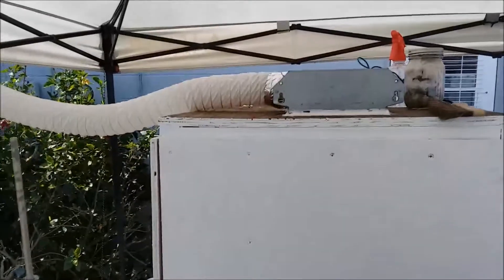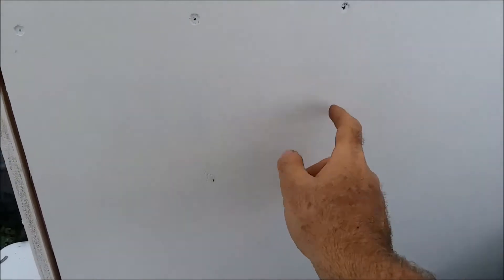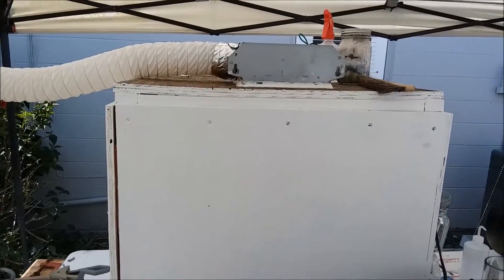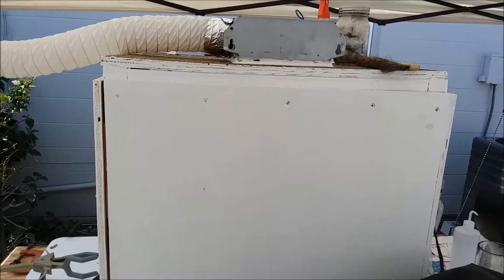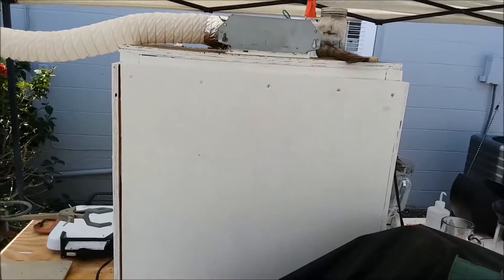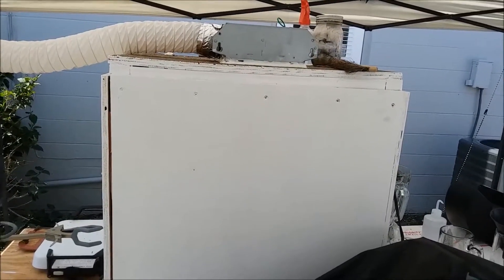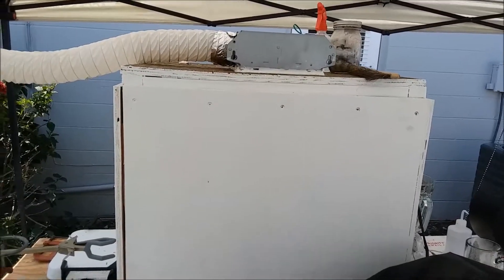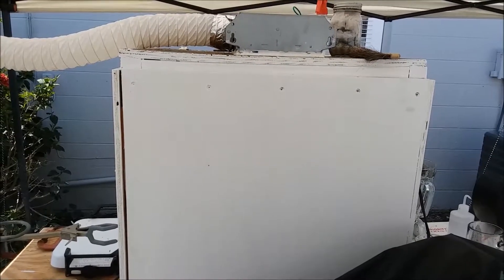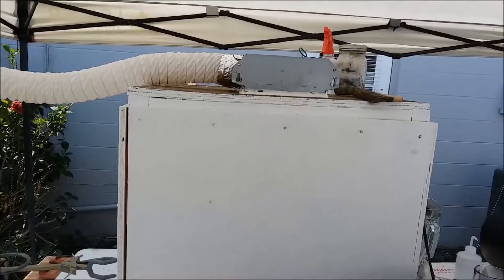When I get a chance — and I always seem to have two or three projects going on — I'm going to move the fan to the back of the box. On humid days the condensation drips into the box, and it does only seem to happen on humid days. We had three days straight of rain and the condensation was terrible. Since then it really hasn't been an issue, but this is Florida — it's going to be humid. So I'll move the fan to the back, plug the hole in the top of the box, and hopefully that will eliminate the condensation running into the box. Condensation will still run out of the fan housing and probably down the back, but maybe I can figure out a way to catch it. Thanks for watching.